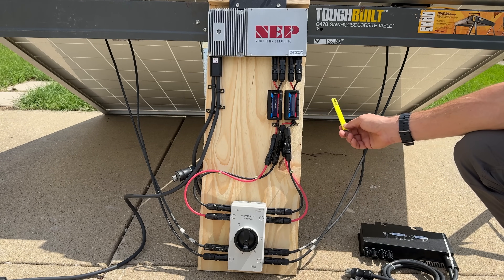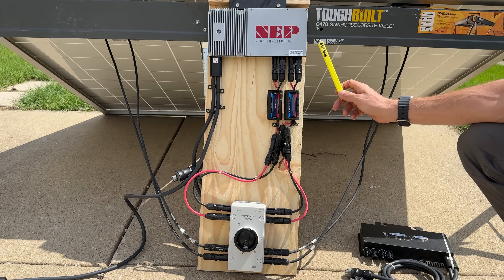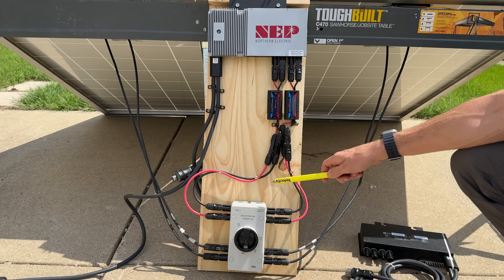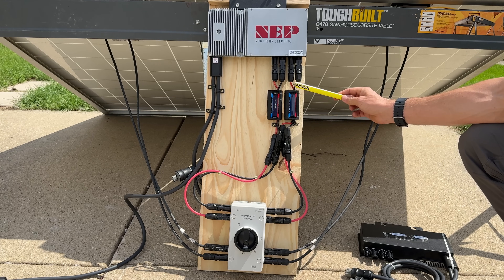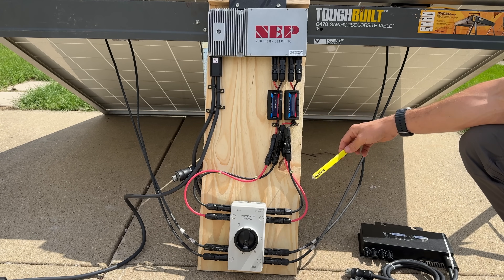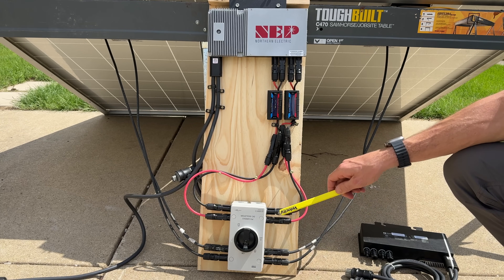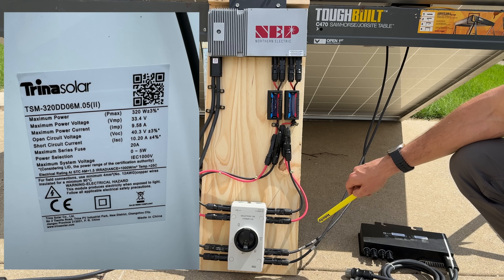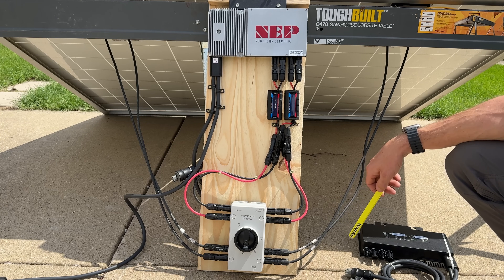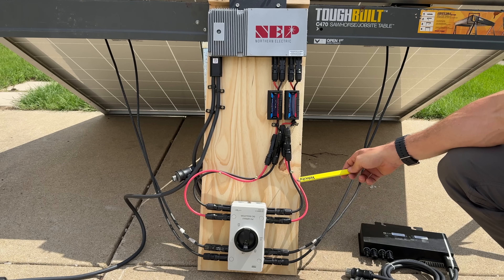What we have here — you would really only need this micro inverter and your solar panels. It's going to come with your extension cord. You don't need the DC isolator or the two power analyzers in line; that's just for testing. We have two 320 watt panels — here are the spec sheets on these Trina panels. These are used panels and I got them for under $100 per panel. You can usually find those on Marketplace, or look for new panels that are discontinued and on clearance.